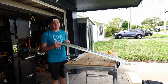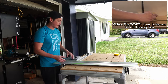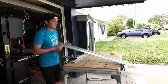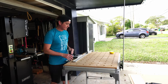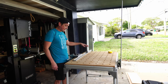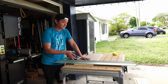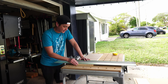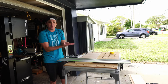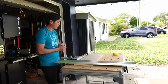In the video where I was setting up the bandsaw, I talked about the fact that one of the downsides of not having a table saw was losing the ability for precise cross-cutting, and this is my saw for that. It's actually my first time using this — a Festool MFT table designed for very specific cross-cutting with a track saw. It's got a miter gauge, fence, stop blocks, and a sweet little track setup. One of the nice things is it allows for splinter-free cross-cuts because the track with the splinter guard and the MDF tabletop apply pressure on both sides.